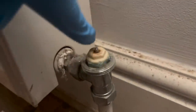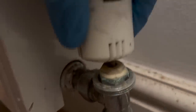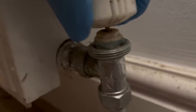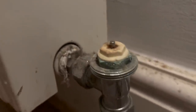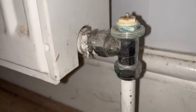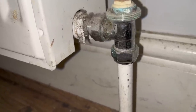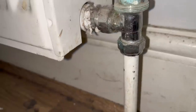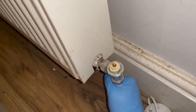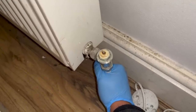Here we've got a radiator that's not working and it's only the one that's not working. First thing I do is check if both of the valves are open. Usually on these TRVs they do get stuck - in terms of how I check it, I try pushing the pin down to see if it goes down. If it doesn't go down, it means it's already stuck in a down position, which means it's off. And in this case it is - it's not going down, so it's off. I'm going to try to pull it up gently, because before I've pulled it with a little bit of strength and the pin comes flying out - and then you've got baking hot water squirting out at you. So do it very gently. Pulled it a few times, pushed it up and down to make sure it's a little bit loose, and the radiator is heating up now.